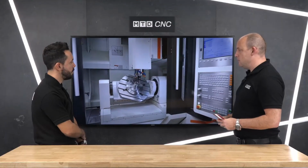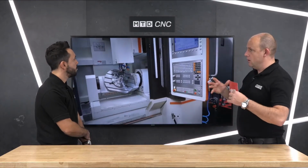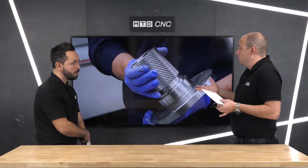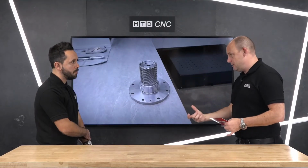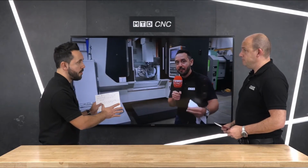And this machine does this in the sense that I'll talk about the dual column machine, the way you've got the stability of the spindle, also the fact that you don't get any thermal growth with these machines. The spindles on these have got cartridges with a heat barrier between that and the casting, so there's no dissipation of heat around the casting, which would cause growth, which would affect the accuracy of gears. There's lots of these things. The fact that some of these gears might be harder materials as well, so they're more durable, the higher speed spindles. You've got a 22 kilowatt spindle on this machine, but it's a direct drive, big plus spindle. So all of those features together give you the precision that you require to do things other than just milling.